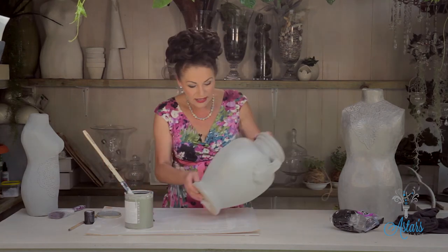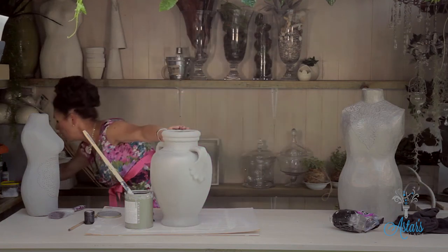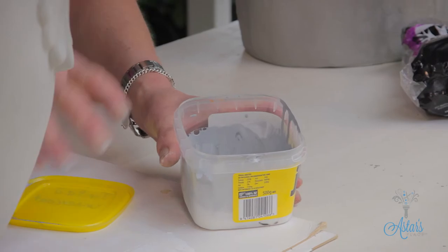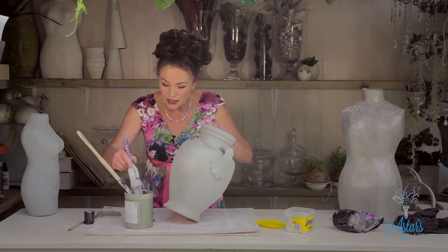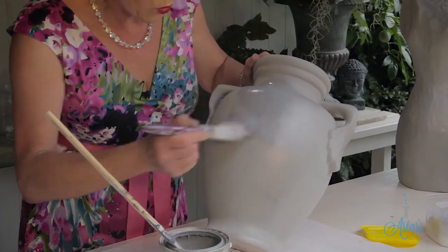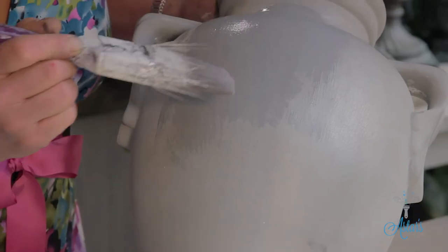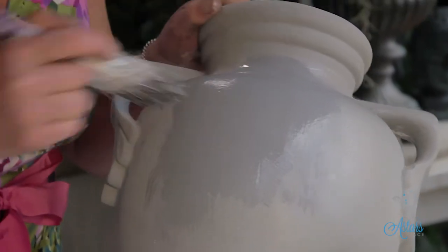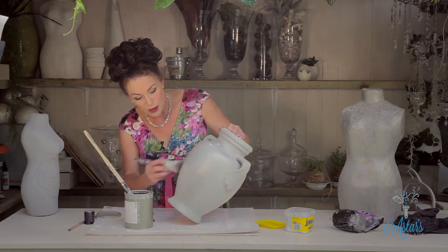The other great thing about this is that the surface is the same colour as the paint — you can see that they're both the same grey colour, which makes life so much easier. With a nice big fat brush, keep that paddle in there, and then just put that all over there. You don't have to be neat about your application. It's much, much better having the tinted base and then putting this over the top because it really helps to cover it. You need about two to three coats — I prefer three coats because it gives a really good cover. The more coats of paint you have, the shinier it's going to be.